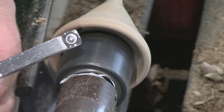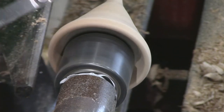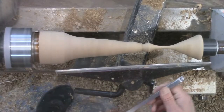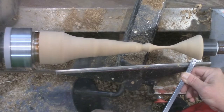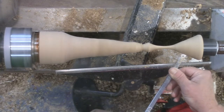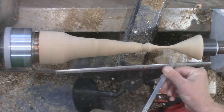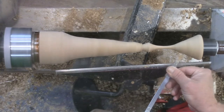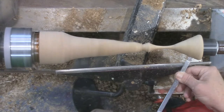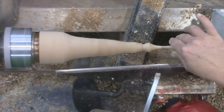Get it where we can stay in focus. So that's got a little radius on the end. Again, it's negative rake just from my last time I was doing resin. But that will allow you, if you're in your carbide tools, to clean up your finish. Smooth things right out, without having the round style cutter. Okay. When I use these, I think of kind of like sanding with the cutter. Keep these nice and sharp, a fresh one. Okay? And you can clean that right up.